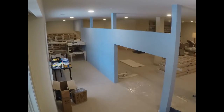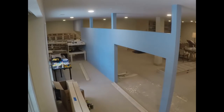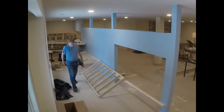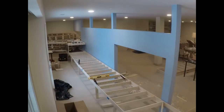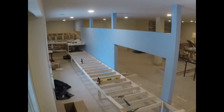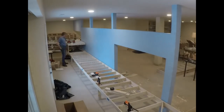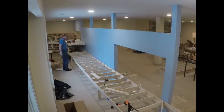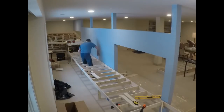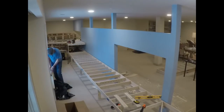On the morning of day two, we started off by getting the ledger boards on the wall for the lower level staging bench work. And here we're putting the frames up temporarily. At this point all the legs are too long — we've still got to get all the levels right and then we'll cut the legs to the right length. Here I've strung the front and I'm gradually getting the sections straight by wedging the back and then screwing them a little bit at a time until the bench work is in exactly the right place.